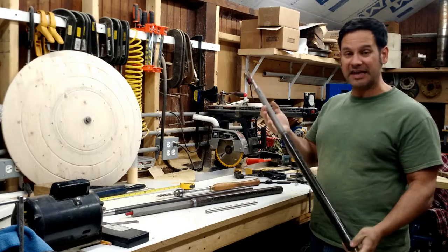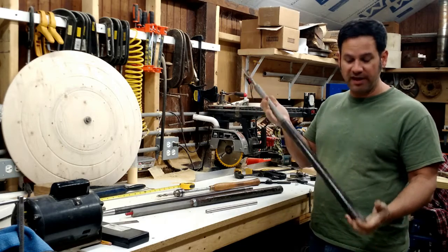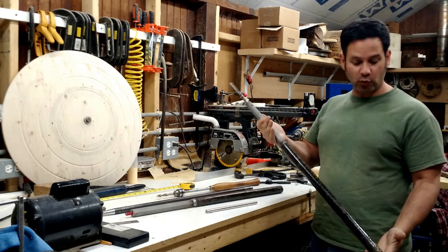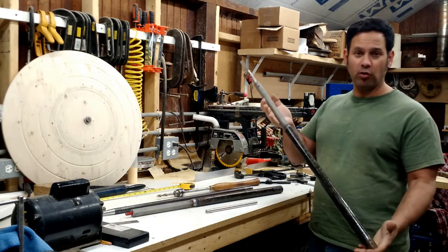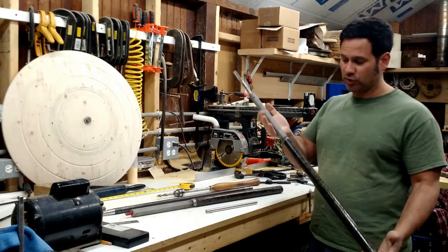It works fantastic. The weight has been great for dampening vibration, and what I might actually do is fill this handle with lead and make it even heavier. I was actually surprised how well a heavy tool works — the heavier, the better, especially for some of the large diameter work that I do. I'm going to put a link in the upper right showing you the pine bowl, the last thing I turned with this tool.